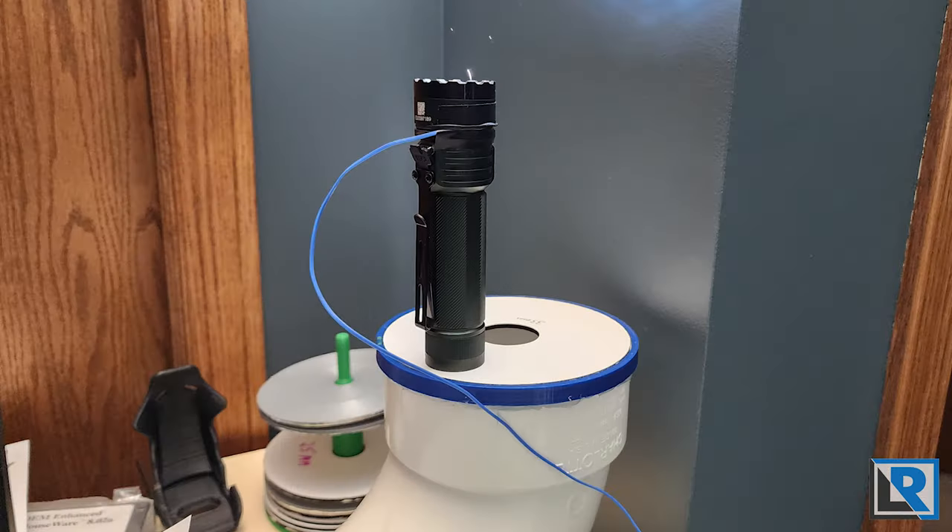Medium 2 is rated for 450 lumens — I measured about 385 — and this is a really useful distance with quite a bit of runtime at this level. You can easily see to the neighbor's fence; it's not overpowering but very useful light. High is rated for 1000 lumens and I measured 940, so pretty accurate. You can see the wonderful color rendering — very nice neutral tint. That's the beauty of this light: the wonderful LEDs and the easy user interface.